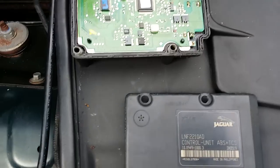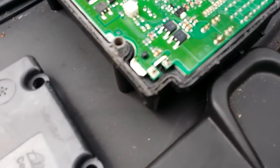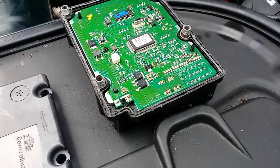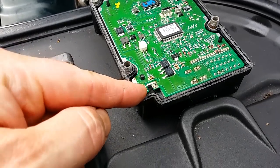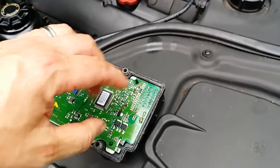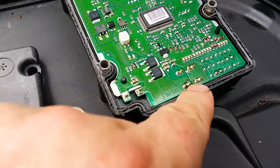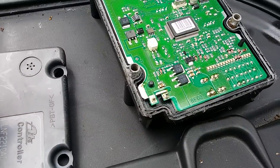What you have inside here is the PCB. You can see just here — these are the pins for the connector on the back, which is for the pump. And I believe these little things tend to go dry. So I re-soldered these along with all the other pins on the connectors to see if that would fix it.